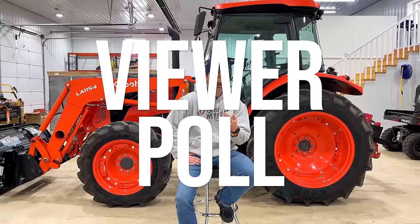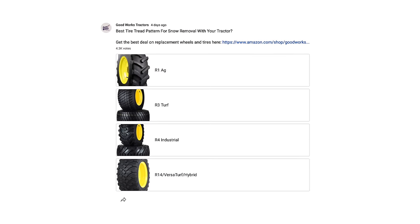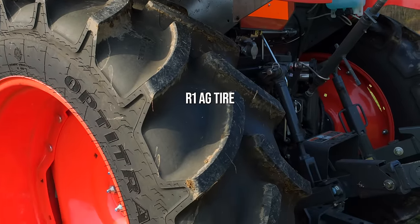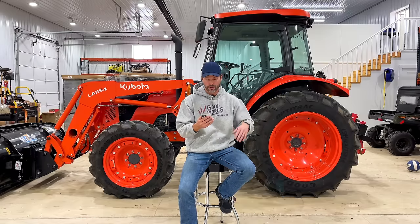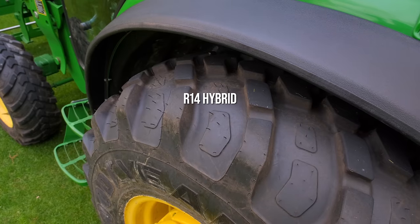I asked folks in a poll on the YouTube community - I do a lot of those and it's fun. This one I posted 16 hours ago as of the time we're filming this. Four options: best tire tread pattern for snow removal with your tractor. The R1 Ag, which is like what's on this Kubota here behind me - the most aggressive, farm-style tread. The R3 Turf, like what you'd see on most lawnmowers sold at Lowe's or Home Depot. The R4 Industrial, the most common tread pattern on tractors these days with the thicker bar tires. And then the newest option, the R14/VersaTurf.